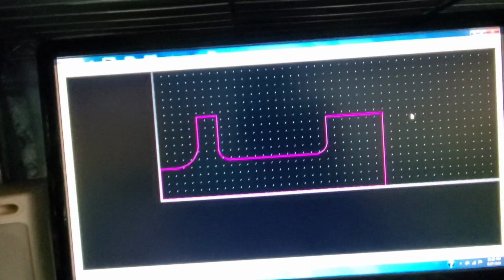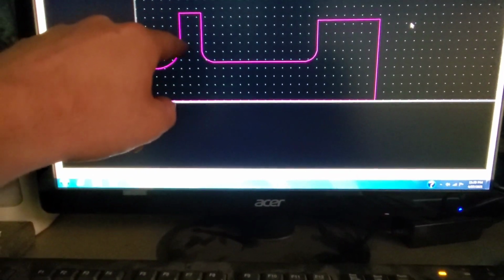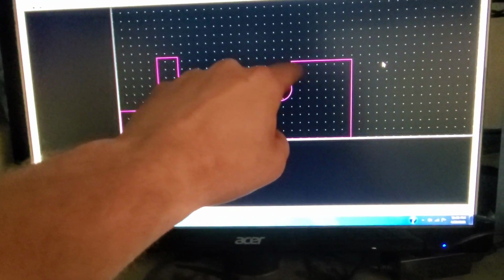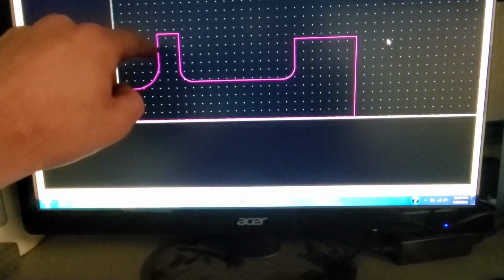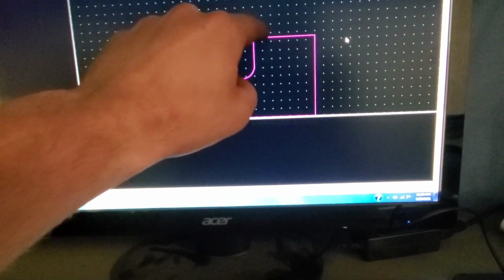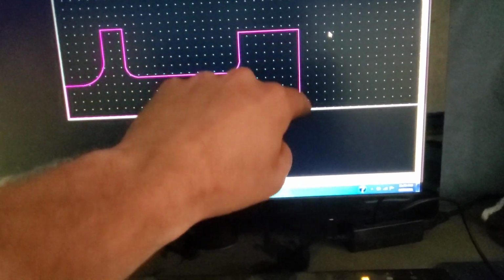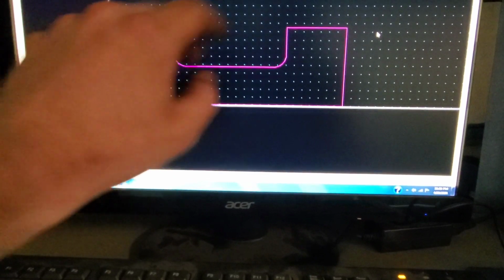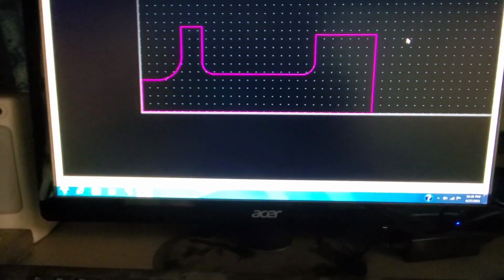Okay, a little bit closer. Got some post-it notes of dimensions and what we're doing. We have an ear for one side, so it's 10.5 on this side, 9.5 on this side. Come back, add in radius to angle up, radius over. Same thing, radius edges, corner down over here. Radiuses, smooth it all up. Bolt holes, and then the front motor plate will be done.